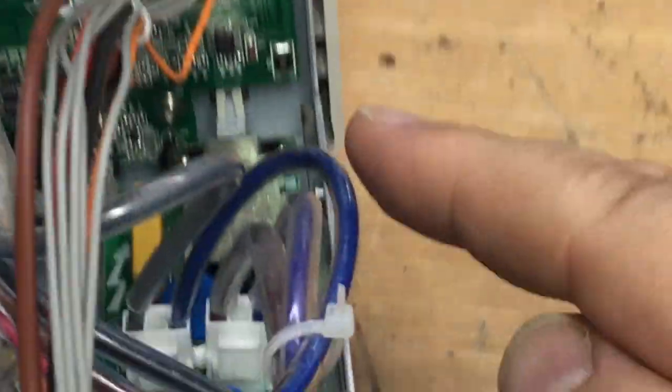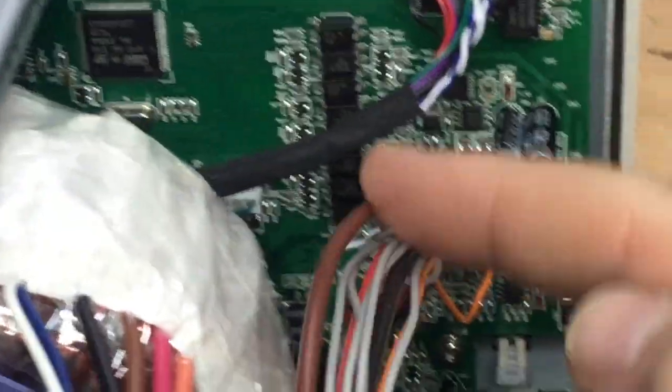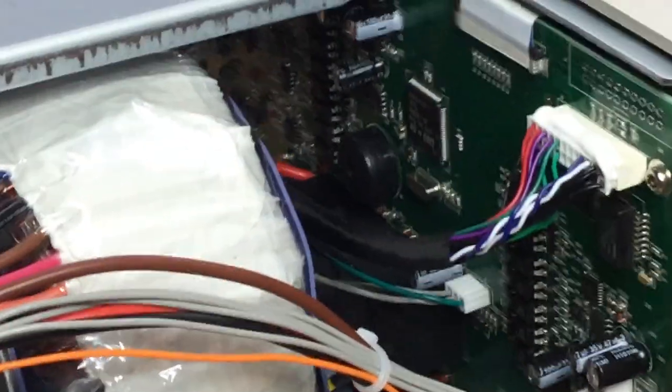And there's some more voltage regulators just down here, which you'll see is one down there, and there's some more a bit further down underneath there, which is difficult to see. But basically, top and bottom of it is, I went round with the circuit freezer to try and coax the fault, because I managed to get it powered up again.